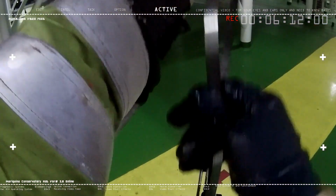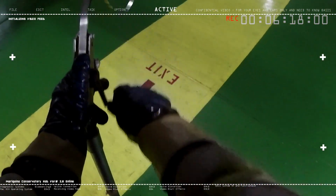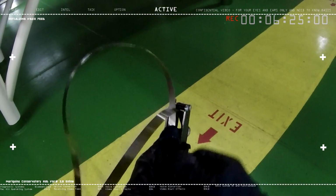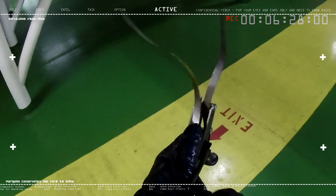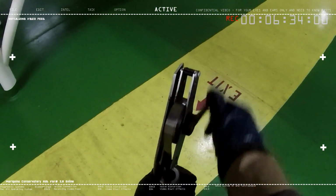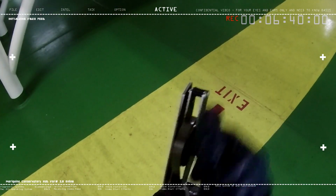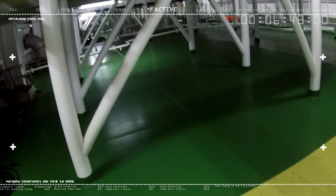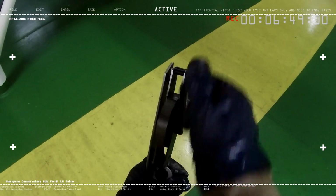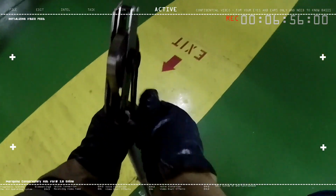I have to yank out the tape and then squeeze it here and then roll this just to retract the tape of the dipstick. After that, we keep rolling it until the dipstick is fully retracted from the sounding pipe. And from the UTI, we would also hear a thud if the dipstick is already fully retracted. So right now, I'm still retracting, so it takes quite a while.